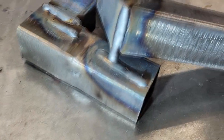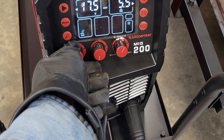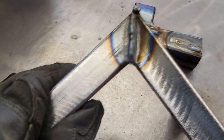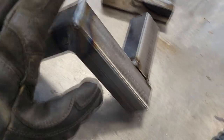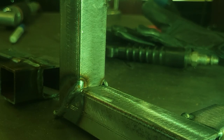We got a little happy with that one — the weld sunk down nicely except for a big drip at the bottom. Yeah, we got a little icicle on that one, but the weld sunk in really nice. We'll just trim that off with the grinder. I kind of like that heat setting better — 17.5 is probably pretty good. I should have changed it before I did that outside, but I forgot. Now we need to do the inside corner — let's see if we can make one good-looking weld here. We're going to do a little loop-de-loop, stack-and-dime, cursive-E on this one.